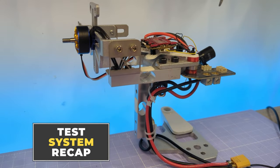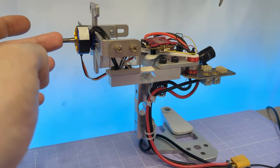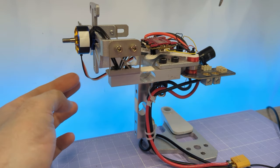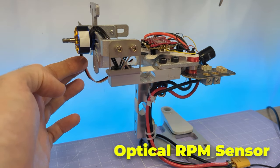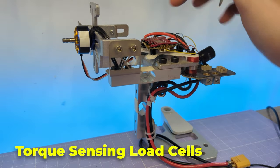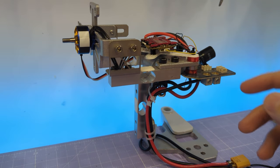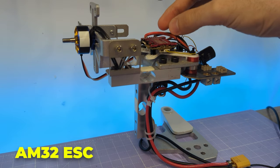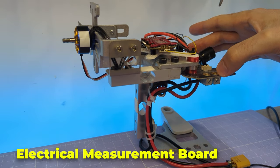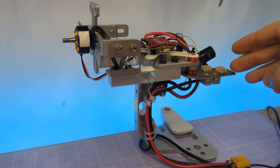Let me take you through the test setup. Starting with the motor — this is the AOS Supernova 2207, which I'm going to be using to drive all the props for this test. It's got a little bit of reflective tape attached to it, and behind it is an optical RPM sensor which allows a very accurate measurement of the RPM of the motor as it's driving the prop. There are a couple of load cells on the thrust test stand used to measure the torque that the motor is exerting on the prop. We also have an AM32 ESC used to drive the motor, controlled by the test board which runs the test according to an automated test script and measures the voltage and current being supplied to the motor.